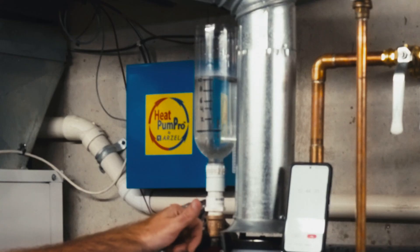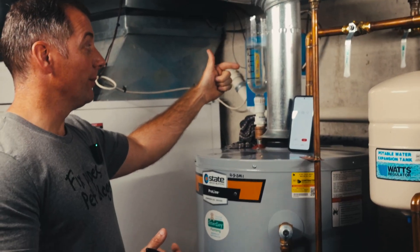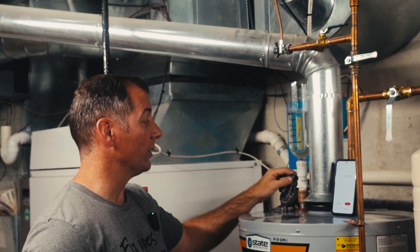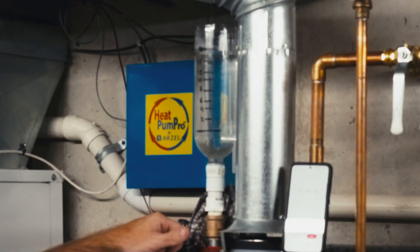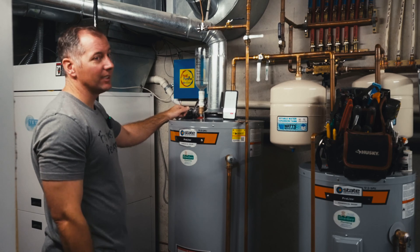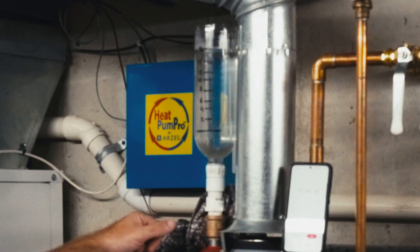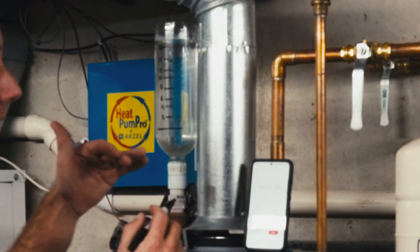We're going to run this all the way to the top — it'll probably take 16 to 18 minutes to fill it completely. We got more air bubbles working through right now from air hanging around at the top of the tank, which really altered the 12-minute reading — the water level just dropped by over a quarter inch. Passing 16 minutes, more air bubbles dropped our level again. Typically your water heater runs for 30 to 40 minutes, so we've demonstrated about half of a heating cycle and you can see just how much expansion we've had. At 18 minutes, we're going to shut the test off.